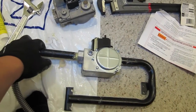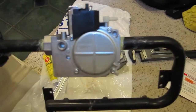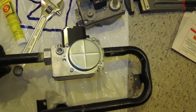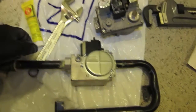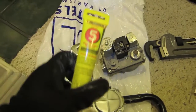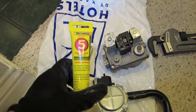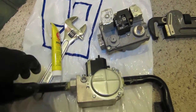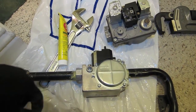This is my new gas valve with the new pipe fittings. I cleaned the threads with a paper clip to remove the old sealant, and reapplied new sealant that I bought — you can get it at a hardware store, I got mine at Amazon. This is a gas sealant, and then I cleaned it with a little bit of water and made sure it was dry.